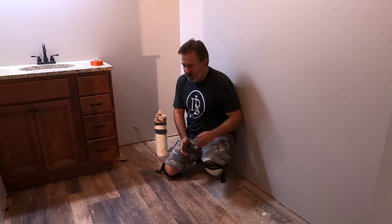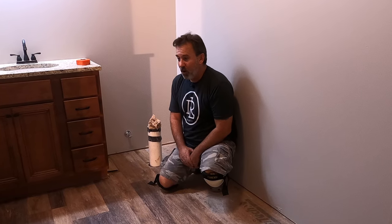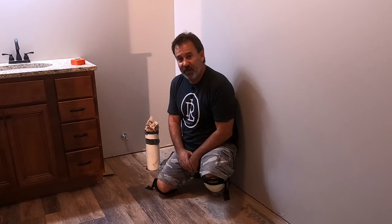So let's get these last boards installed in the bathroom, and the upstairs loft will be done with our Lifeproof Walton Oak vinyl plank flooring. As we finish up with this job, you may be wondering yourself, Tim, hey, what do you do with your shower or tub edge and your expansion and contraction gap? Well, the boards in this application run this way, so they're all jiggity-jaggity at the end there, and you've got a quarter-inch gap, and you have to allow for that expansion.